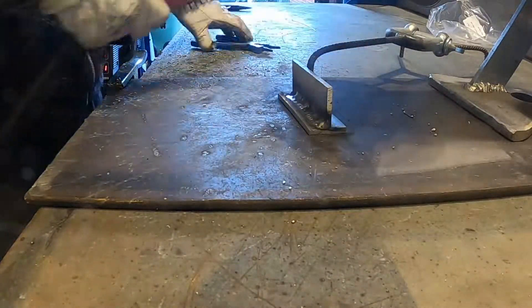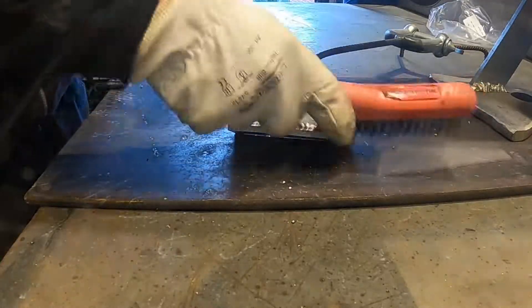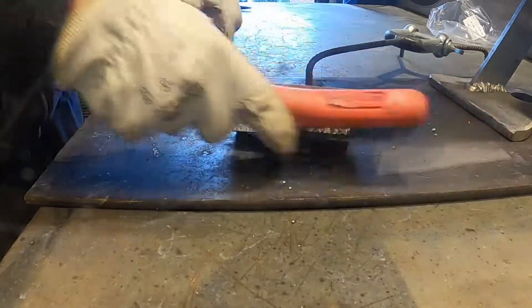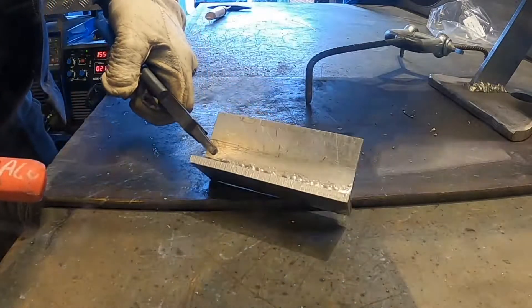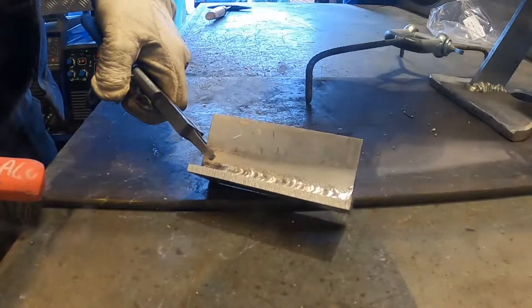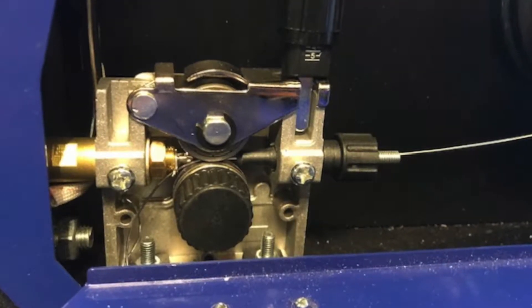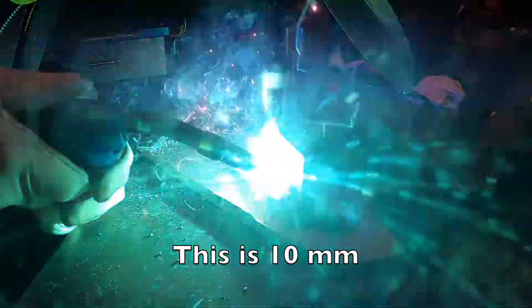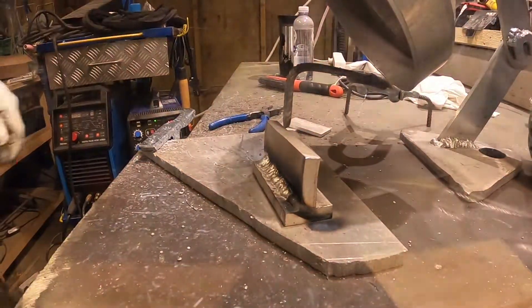It works great — way better than before. As long as I stick to the spray arc method with fairly high voltage and low wire feed speed, it doesn't cause me any problems. But the wire still curls up inside the machine if I get a burn-back and it gets stuck to the contact tip. This happens all the time when I'm welding thin materials with low voltage.